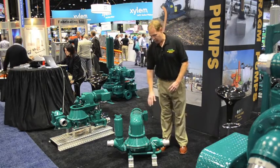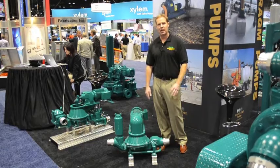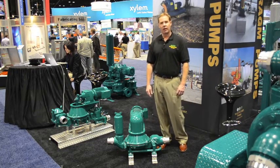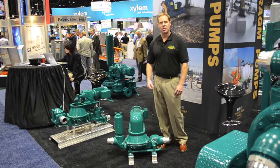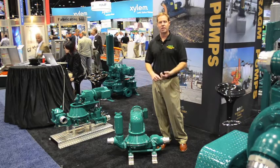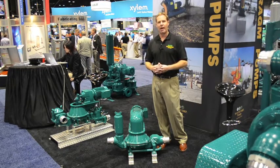It's standardly equipped with aluminum casting bodies which can be coated for any type of chemical application that you may have. The flappers inside are Viton and the diaphragm is standard Santoprene, which is an excellent material for any type of sludge application in industrial or municipal applications and any oil type of application as well.